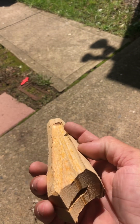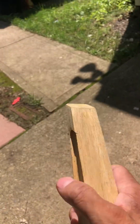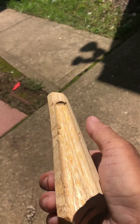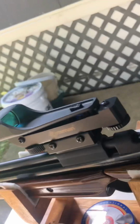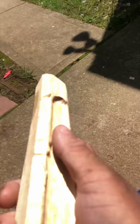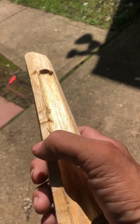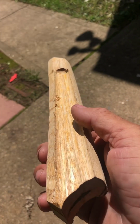And another mistake here was that I wanted this round edge here at the bottom. So once I did the groove, I tried to make a round and it ended up looking very thin. So that gave me an idea. And the idea was to do the routing first, around the router here, and I call this round. Do the routing and the round first before doing the carving here. So I did a round here, I did the routing, and then I drew the groove the way I wanted, and then I machined it.